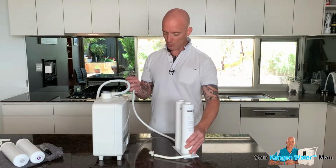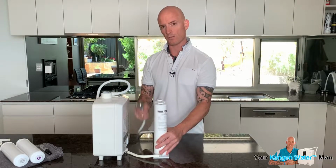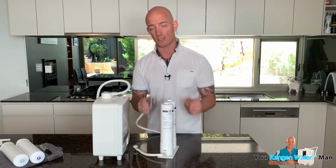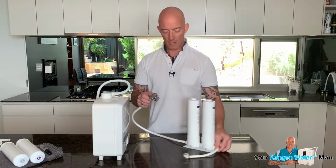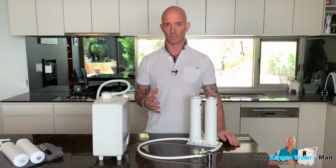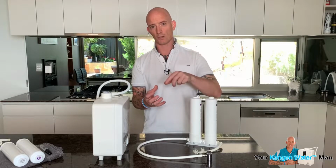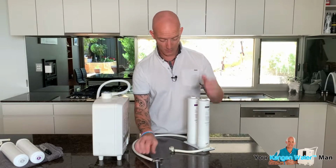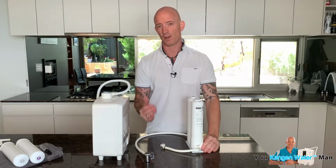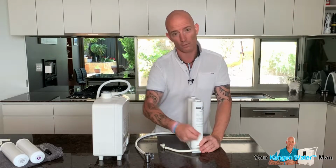So what I'm going to do here now is, once you've cut it and you're confident, when you've screwed it in and done a dry test, and a dry test means you haven't connected it up and you're happy with it being in place, then go and boil the kettle. Get a cup and pour the boiling hot water in the cup, and then get the ends of the pipe in there. Just be aware of your fingers, so that you don't burn them. Basically, leave it in for maybe 45 seconds, 60 seconds, and then take it out and start twisting it on.